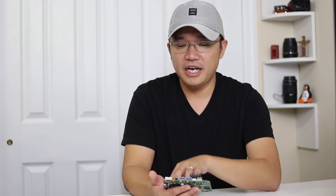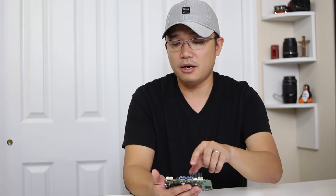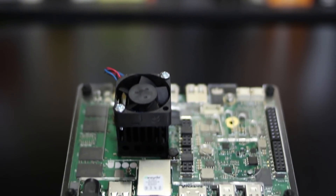Today we're not really gonna be looking at the Arduino pinouts, but it's gonna be like any other board where you would communicate through a COM port to talk to those Arduino pins. We are going to be installing a virtual machine server using Proxmox. The reason we're going with Proxmox over ESXi is because Proxmox supports QEMU, which allows me to emulate different hardware chips - so instead of Intel I could emulate AMD, or ARM devices, and I could ultimately put any operating system on here including Mac OS. You can also buy a really cool acrylic case, a fan, and M.2 adapters from their site.